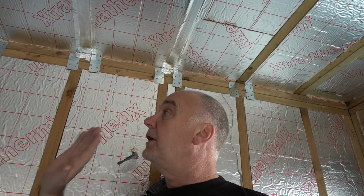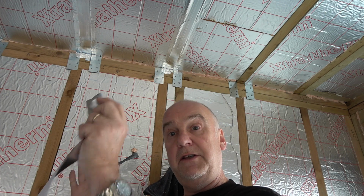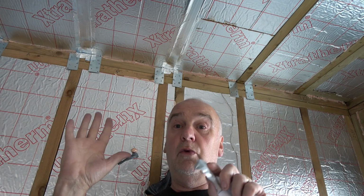And in the winter time, when you're warm and it's cold outside and all your doors are shut, I mean, you've seen this is sealed, it's properly insulated now. So you've got cold outside, warm inside. At some point between the outside and the inside, there is a point of equilibrium where this temperature starts to morph into that temperature. Then usually in the middle of this insulation, in the middle of your wall, is what they call the dew point. I'm not putting this very well, am I?